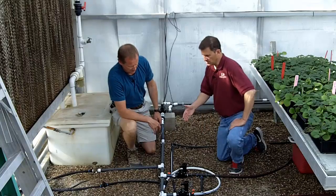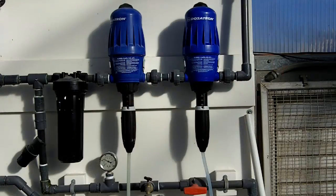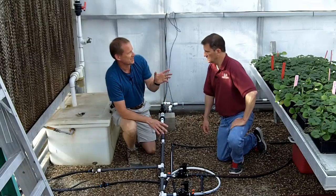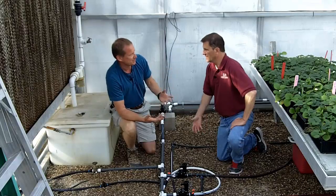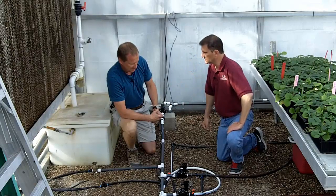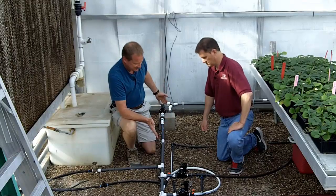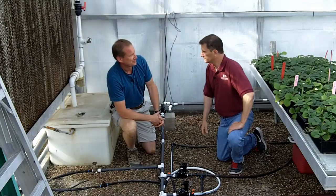You mentioned on the injector board that the injectors function just by water flow — they don't need electrical power. That's right. As soon as a valve is open, the water starts flowing and that begins driving the piston in the injector — that powers it. So this is where you're really controlling with the clock and with the solenoids your irrigation timing and frequency. This is the whole thing that determines when irrigation runs, when the injectors inject, and how long.